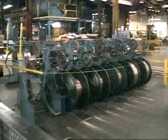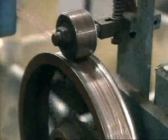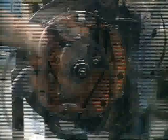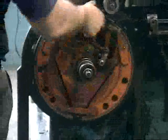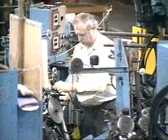These spools of wire are being grouped into a bundle, formed into a hoop, and coated with yet another rubber compound. The bead is the part of the tire that will be forced into the tire rim and form the tubeless tire seal — it needs to be very tough. The rubber-coated bead is given a cloth coating at this stage to further add to its strength.